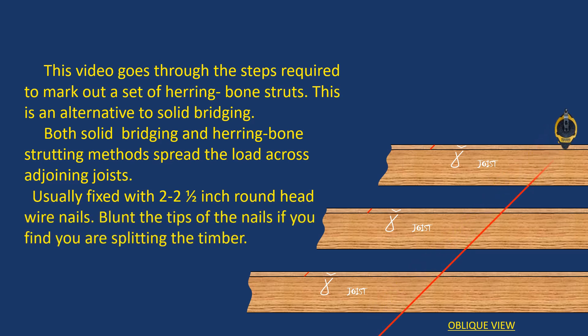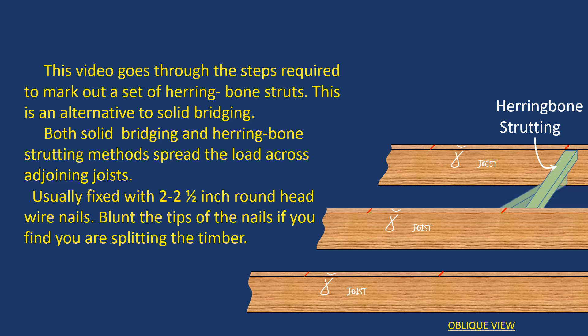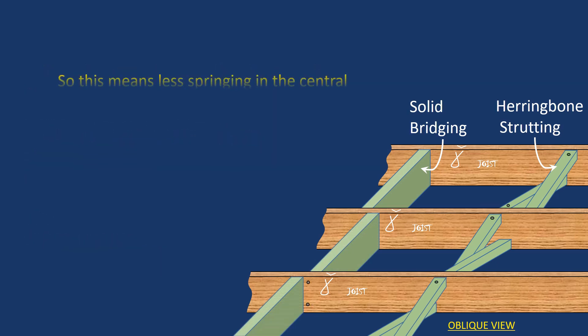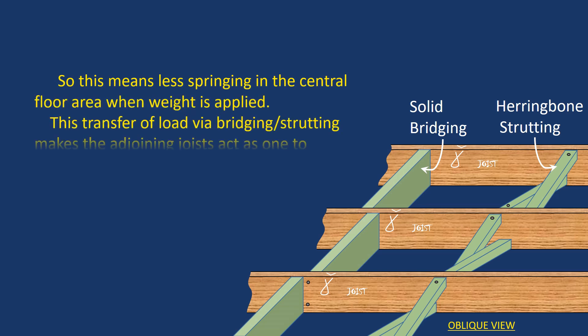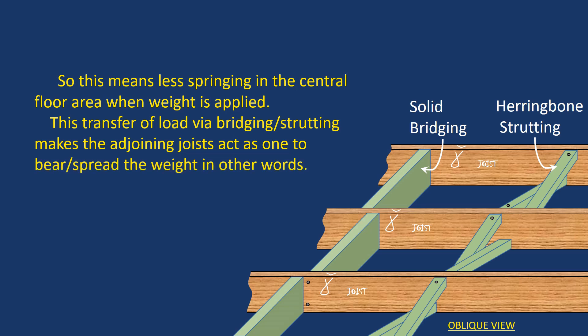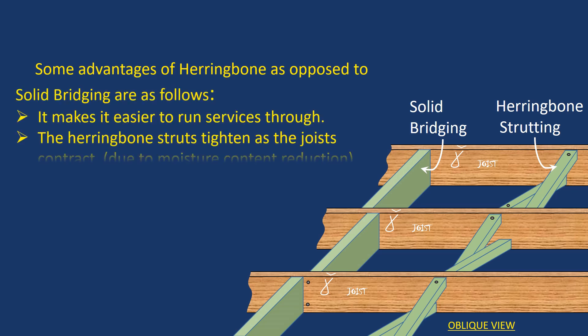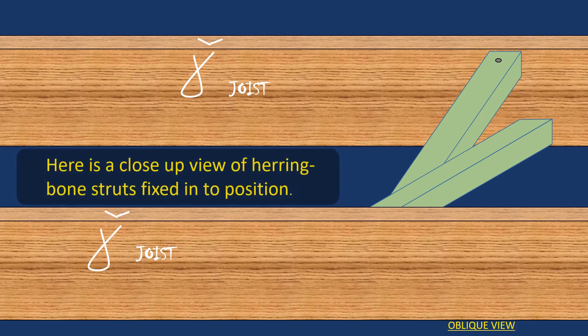As you can see here, you'll snap a chalk line across mid-span of your joists in a typical room space, and you'll put in your set of herringbone bridging as indicated. They form basically an X between the gap between the joists — usually those joists are at 16-inch centers or 400mm centers. Here you're going to see what's termed solid bridging. Introducing bridging between the joists will make the mid-area less susceptible to springing, which might cause a crack in your ceiling below, or squeaking when you're walking on it.